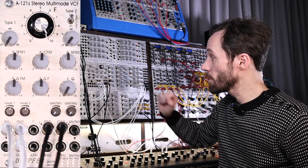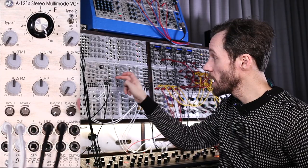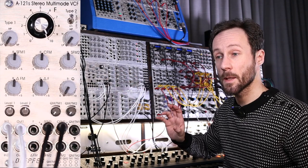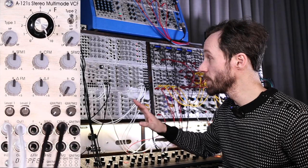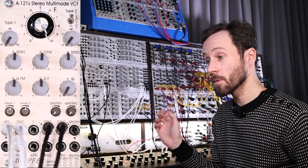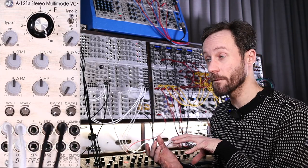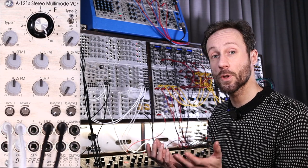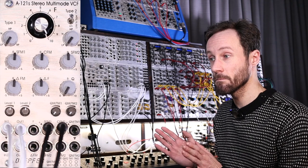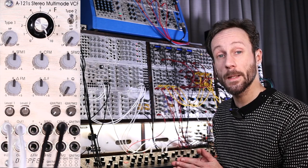Then you got the QMTM1 and the QMTM2. I would start with turning them all the way down. And if you know the module a bit better, try to see what they actually do. And also, before mounting the module, see how the jumpers are configured, and compare that to the manual, because I didn't do that. I was not too sure if there were jumpers, so I was a little bit excited.